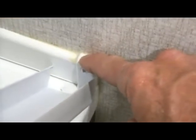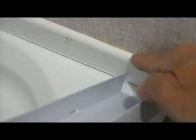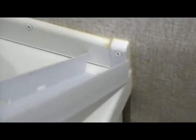The first thing before you start is to check your fit. I've got the bottom piece — I'm going to take out this little end cap, and then the trim that goes along the bottom of the tub, I'm going to shorten that up. I'll undo my three or four screws, cut out the silicone with a knife, and trim this down so our back piece will fit up against the wall and won't push the bottom out. You won't have to put a bunch of silicone in there trying to seal it. We'll remove that, trim this down, and get to mounting the bottom.